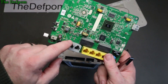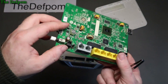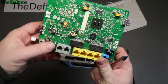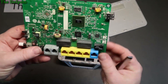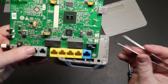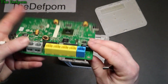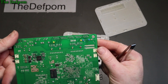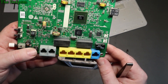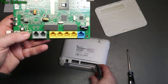So this is the phone line connections, which go up through here. There's some isolation caps, a little transformer - phone line transformer. And obviously this is all the Ethernet port stuff there. That is another transformer just here, which seems to be going to this chip. I'm not quite sure what that's doing - maybe that's supposed to be a protection system. Because that's the main WAN connection, and those are all LAN ports.